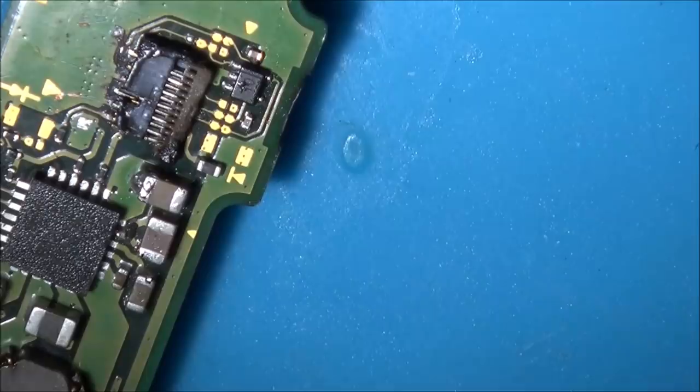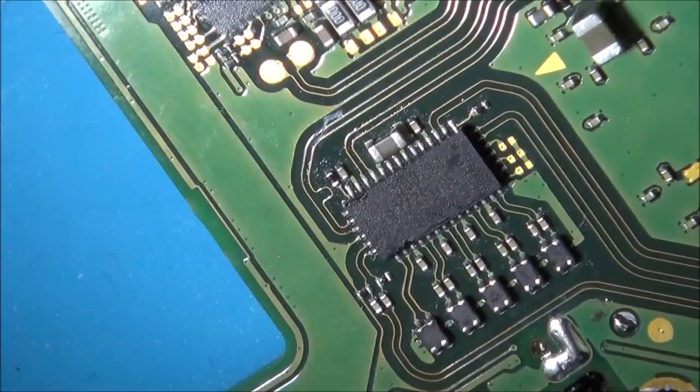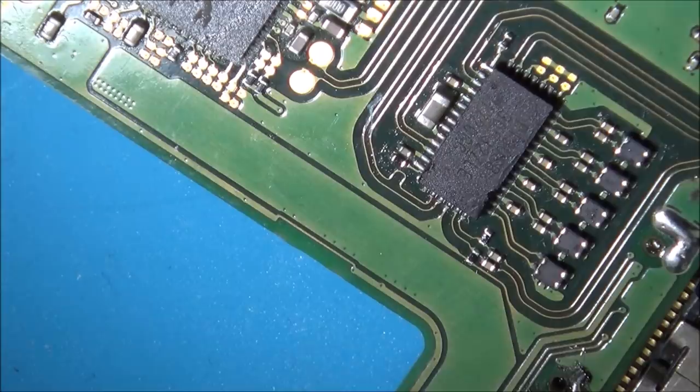Right, so let's now check out this video chip here, see what's going on. Now, I'm not saying it is faulty, I really don't know, but the very fact that it's not outputting to the TV and not outputting on the screen makes me think that maybe it's this chip that's faulty. So what I'm going to do is use some flux, use some hot air, and take it off,